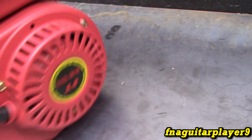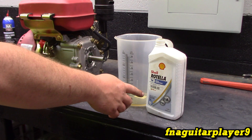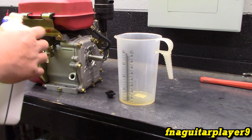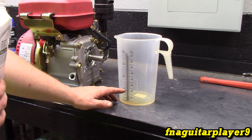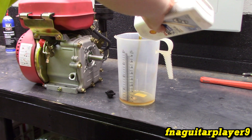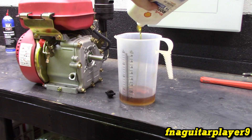Let's get some oil in it, get it mounted, and get the injector bled. The type of oil I'm putting in is diesel engine oil, 15W40. The engine takes 0.7 liters of oil — that comes out to 700 milliliters. So I'm measuring out 500, 600, 700 milliliters to take the guesswork out of it.